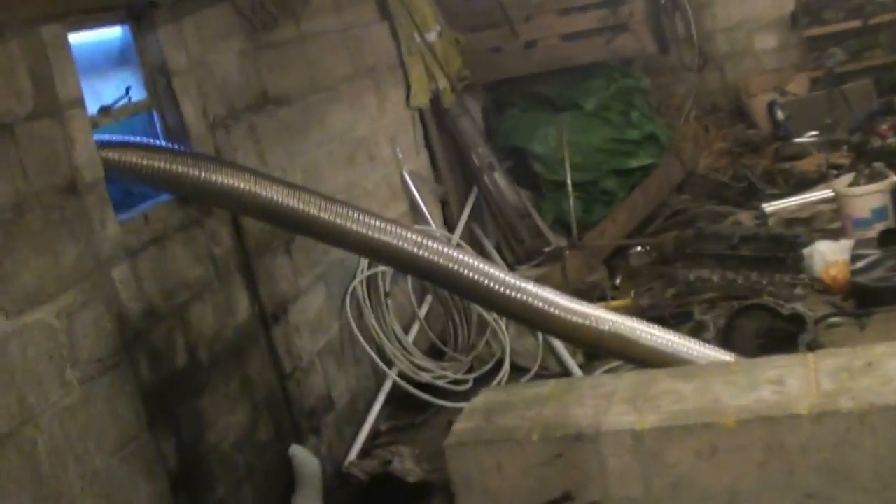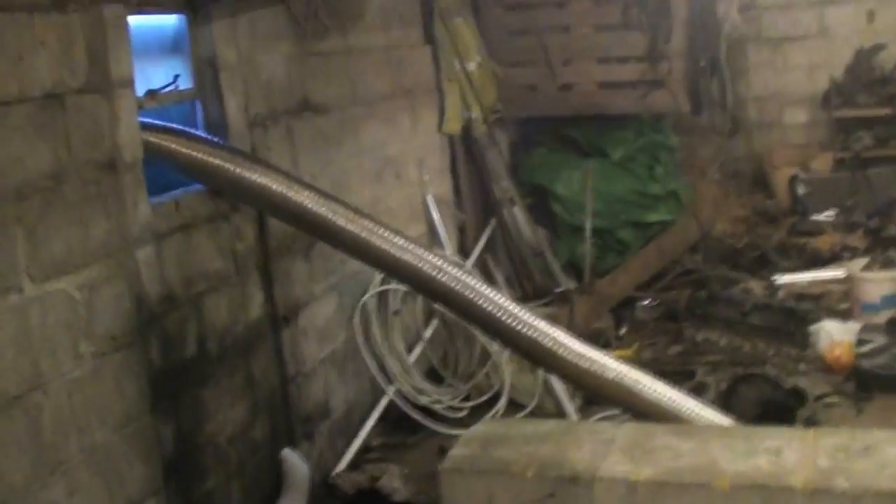I've just bolted the extractor on the wall, which is kind of the next little phase I'm working on at the moment. We've had a few cars in here now and obviously it's not really a great idea having cars running in here at all, let alone on load with no exhaust extraction. A pipe out the window is certainly not really adequate — it was good enough to test it. But we did actually have a gas analyser in here and the carbon monoxide levels, although remaining safe, do start to creep up. So we definitely want to get this exhaust extraction sorted ASAP.